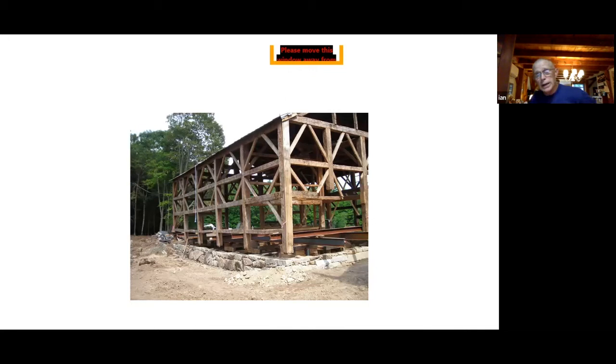This is a bank barn in New Hampton showing a completely repaired dry laid frost wall foundation ready for a new floor system to go in. It's a beautiful timber frame barn — you can see all that knee bracing, and the top timber running across the gable end is a single piece. There are single pieces on the top plate running the length of that barn, so there's a lot of structural integrity. You want to maintain that when doing repairs, because that's what makes a barn survive the movement of a dry laid foundation.